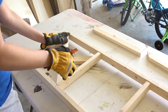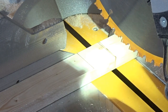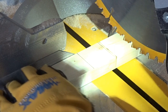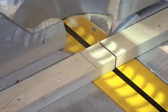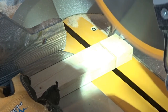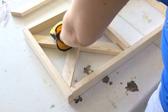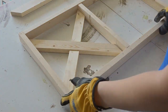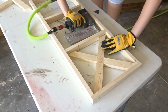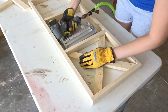The extra step you'll need to take with this side is to mark the sides of your center piece that you'll be cutting out. Here's a look at how I cut out that center portion of the X — you'll also need to adjust your angle on your miter saw for this as well. Here's how your X pieces should all fit together. I used my nail gun and 1¼-inch brad nails. I did the two outer X's first and then worked on the center X last.